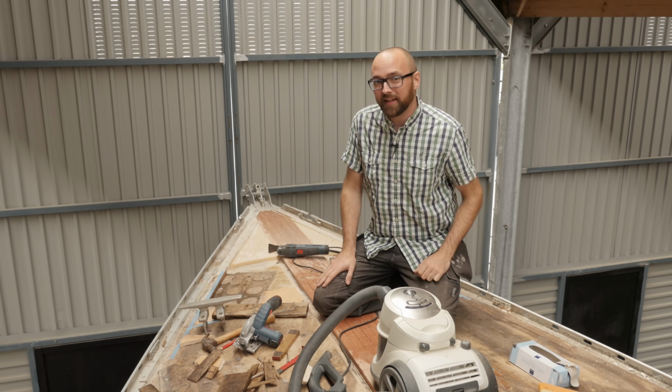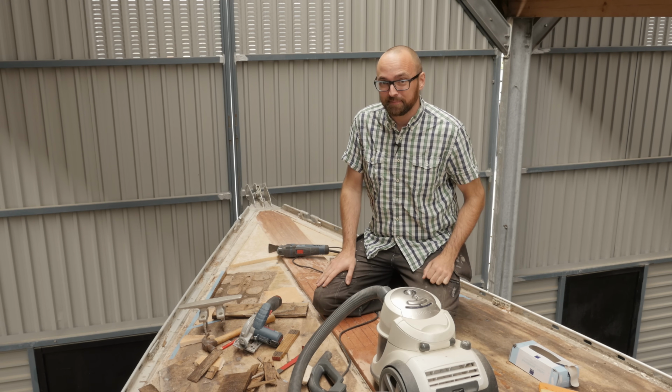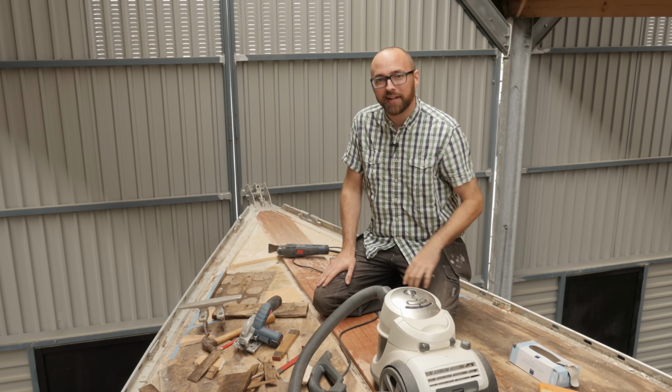And to do that, I think I'll use my vacuum pump a little later today when it's done drying out that section of hull, that is. If I put that wet piece of plywood under vacuum and I'm able to pull a vacuum of, let's say, 29 inches of mercury, the water that's in the plywood will boil off at around room temperature, or to be more precise, at 24 degrees Celsius or 76 degrees Fahrenheit. So for drying out that plywood, I don't need to apply both heat and vacuum. Just pulling a vacuum should be enough.